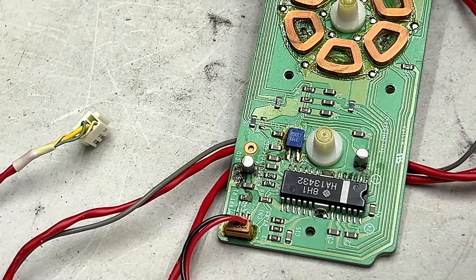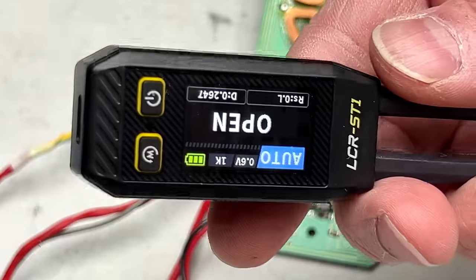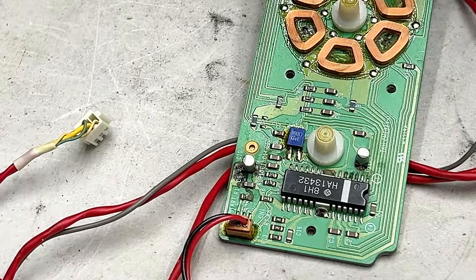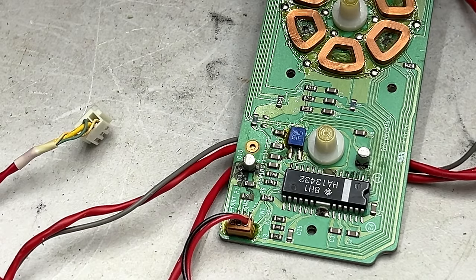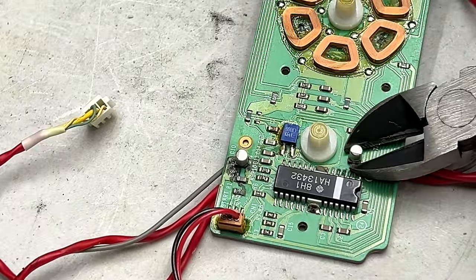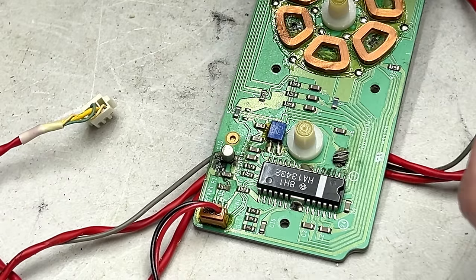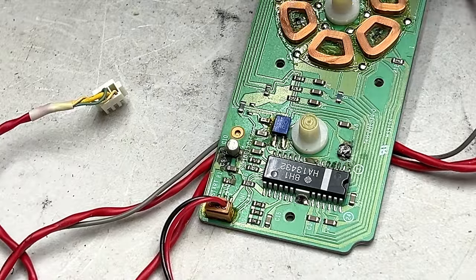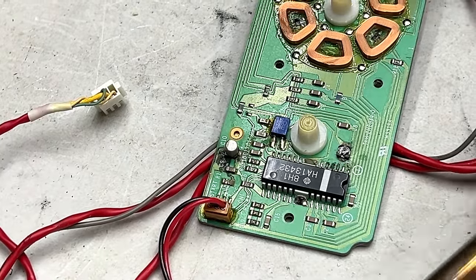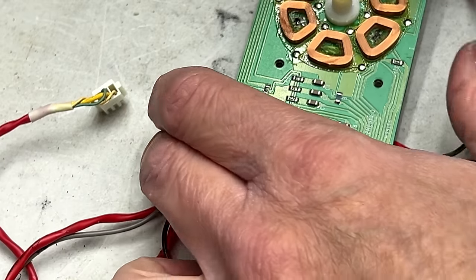So yeah, we gotta get started with this because these capacitors have to go yesterday. I was checking them with my new tweezer doohickeys here, and I can't get a reading off either one of these. They're that bad. So let's jump to it. Gotta use the cutoff method. Get my iron out. Blob some fresh solder on it so we can get through the corroded solder.